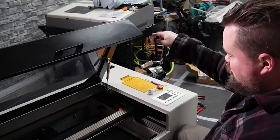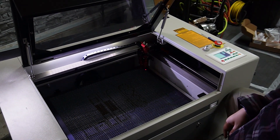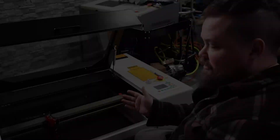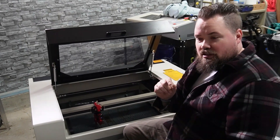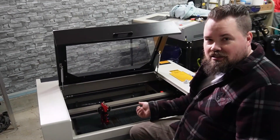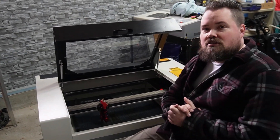Side panels closed, plugged back in — turning it on to see how it runs. Perfect. You can actually watch the lights come on as it triggers the limit switches, and everything looks great when it bounces off and comes back. We'll get the laser head swapped out next. Limit switches are working great. Make sure you have connectors on hand — the right ones would be nice but they don't send them. The only real issue is that the machine is so low it's very hard to work on, but outside of that it's really not that hard. Any questions, leave them in the comments — like and subscribe, see you next time.